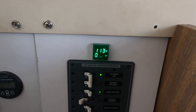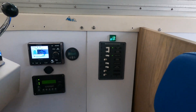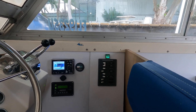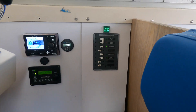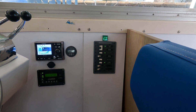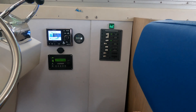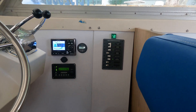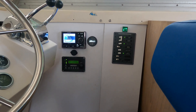What this is doing is allowing me to limit amperage without needing some crazy sophisticated system — it's nice, simple, and user-intuitive for just anybody to use. You can manually limit the air conditioner without fully shutting it off, still maintain a comfortable cabin temperature, run something else without overloading your inverter, avoid depleting your batteries too rapidly, and keep a nice full day out on the water.